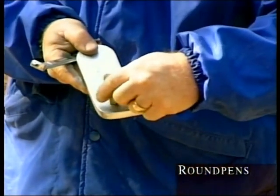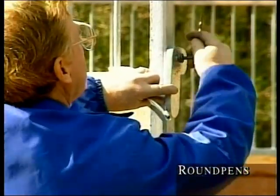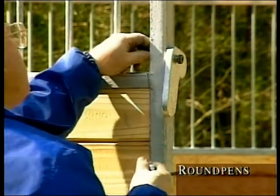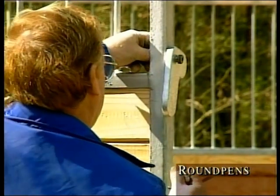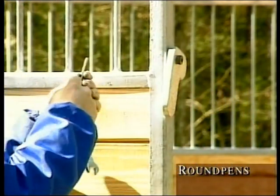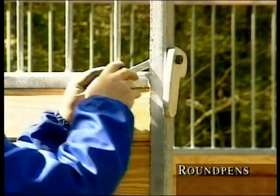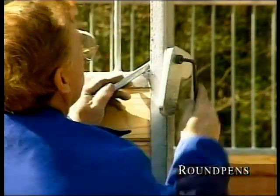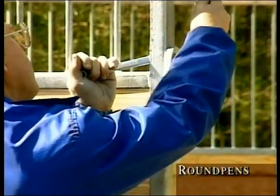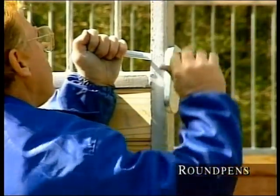To add the door handle, put a half-inch shoulder bolt through the hole in the handle and the door frame. Using a quarter-inch Allen wrench, tighten the shoulder bolt, adding the nylon locking nut to the backside and tightening with a wrench. When the shoulder bolt bottoms out with the locking nut, the handle is in place. The locking nut will prevent the shoulder bolt from backing off, securing the door handle permanently.